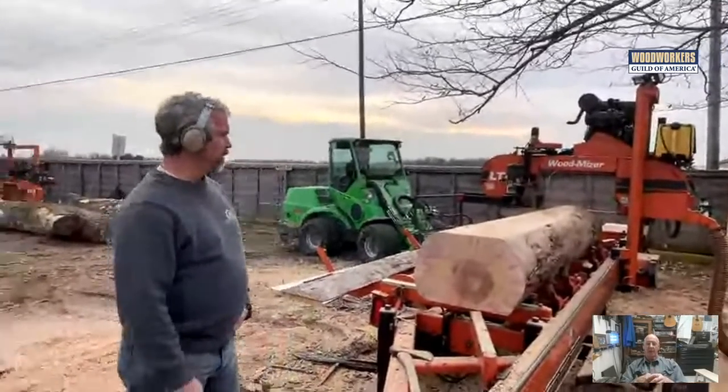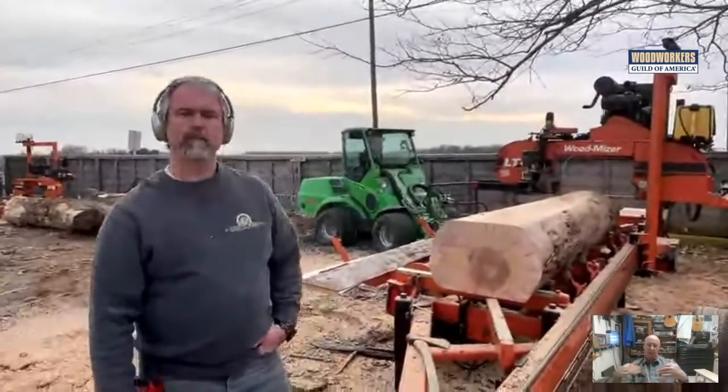And I think let's go back to that. You were talking about basically not leveling the log, but leveling the pith. And when I teach logs to lumber, I talk about this a lot, and people struggle with it a little bit. You have to work on that sawmill to make sure that you're cutting parallel to the center of the tree from a growth perspective, which may not be physically the center of the log, so that all your cuts are parallel to the grain and you don't end up with short grain.